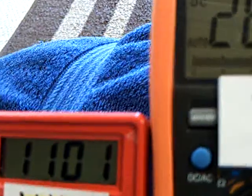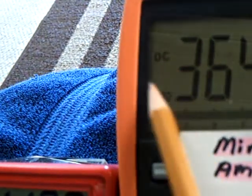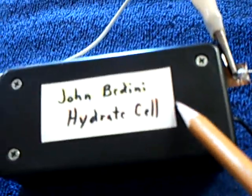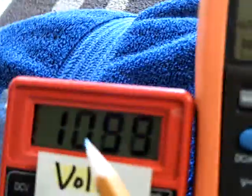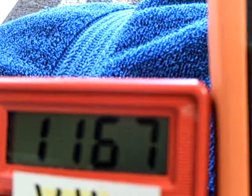What I wanted to show here was: if I put the flashlight on the solar cell, this is going to go to a minus — it's going to feed energy back into this cell. This voltage here is going to climb. Let me do that — I'll put the flashlight on it. Notice the minus now on the meter. Notice the cell voltage has gone up.